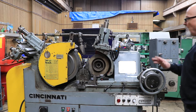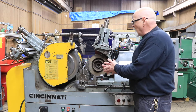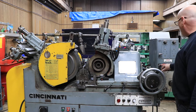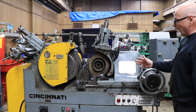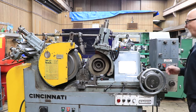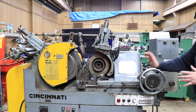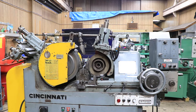If you were doing in-feed grinding — where you were putting a part between the centers manually or with the loader, it was coming in and grinding it, then opening and the part gets ejected or removed somehow — then you would use this. When I press the button in the in-feed mode, the wheel's going to go forward at a certain speed, stop, and start to do its feed rate. It's going to get to the end of its travel or zero, then start a dwell time. At the end of that, it's going to retract and go back again — that's one cycle. It also has a continuous mode that you would set up with your loader so that this can go in and out continuously, parts being put in and picked up.